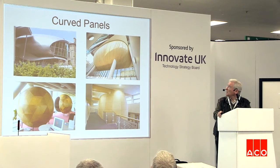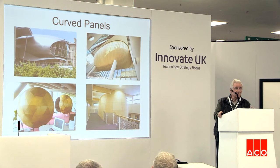The Birmingham Medical School on the right is faceted in that each plywood panel is only bent in one direction. They're only about 600mm wide and you can't really tell they're not following the curvature. Bottom left, Peckham Library — we had to press those with a double curvature; those spheres were completely unforgiving in that respect. And Napier University building at the top is a combination of both: quite a lot didn't need the double curvature, but there are a few areas where the radius is tighter.